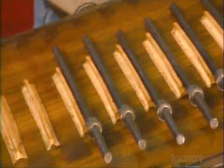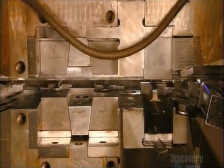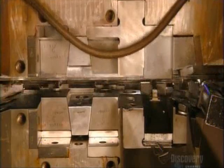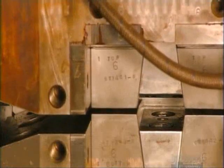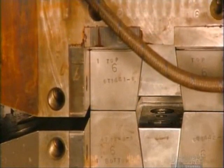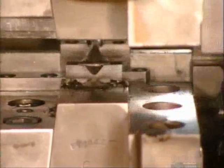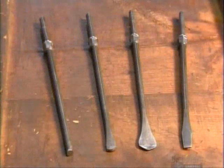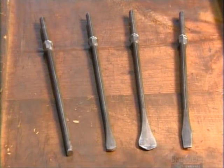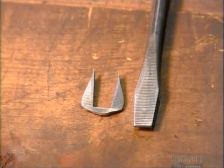At the first two stations, the press flattens the tip. The third one trims it and stamps the part number onto it. The flat blade is probably the most common of screwdrivers, and its chiseled tip turns a standard slotted screw.